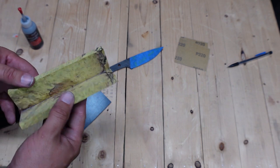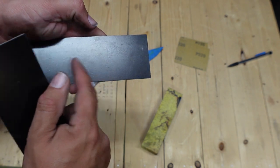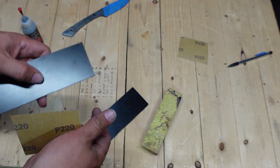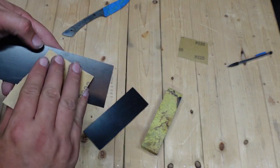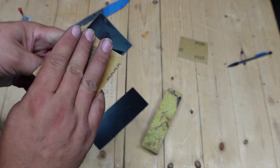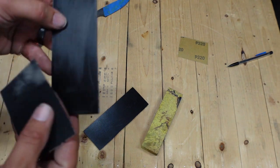What we've got to do now that we have these already flattened is we need to go ahead and sand this material right here, because that glue is not going to want to stick to this high-sheen area. So we're going to grab some 220 grit sandpaper and just scuff all of this. We're not removing a ton of material — all we're doing is creating a whole bunch of little scratches all the way around the flat area. We just don't want that high-gloss surface.